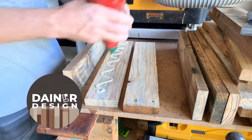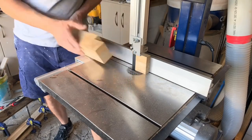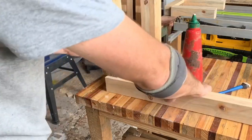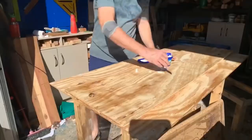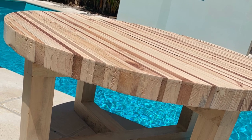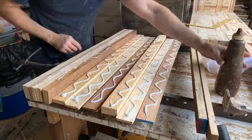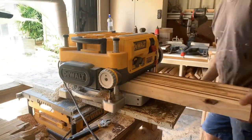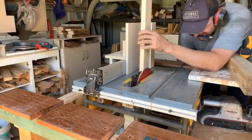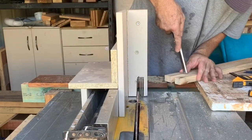Using up a heap of offcuts — the normal cleanup routine, glue and clamp, attach the cross rails. I do the joints with a table saw and a band saw. Here's another view of how the half lap works. I'm putting spack filler in the big knotty holes because they were going to stand out like dogs balls on a canary. Then it's just a matter of doing some circle work. I basically flattened all my slats — my profile was going to be a little bit out of whack — using the table saw to avoid using a chisel as much as possible.